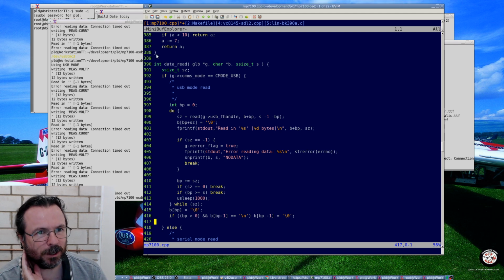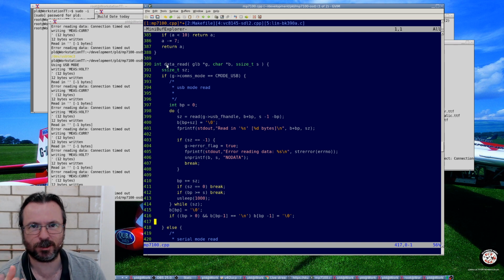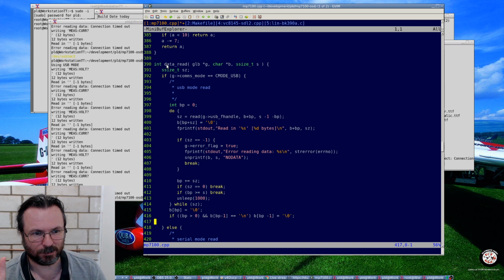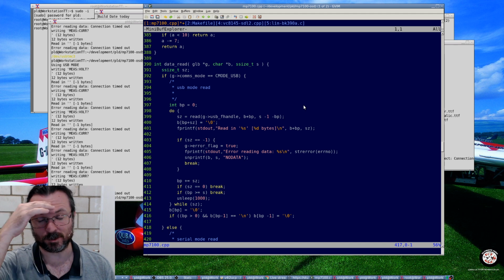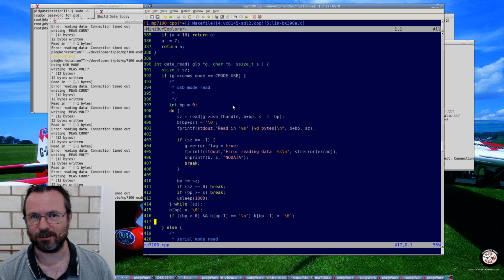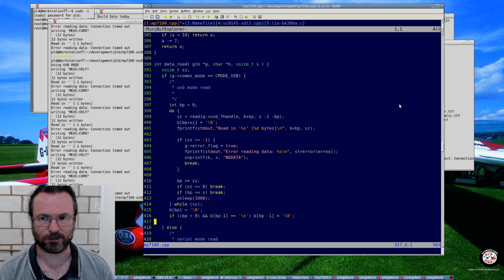Serial ports can be a real pain with a lot of the equipment, because instead of the equipment makers putting the right electronics in to give the serial port its own power supply and isolation, they just put in a dumb port with just 2 pins connected, maybe a third, and let your PC be a proper powered COM port with original old serial levels, plus minus 20 volts, that sort of stuff. And so you end up having to have a dedicated original old COM port in your PC just to get them to work.